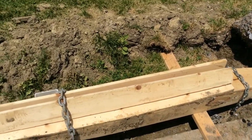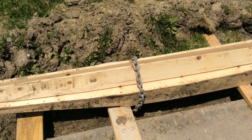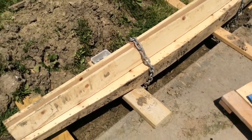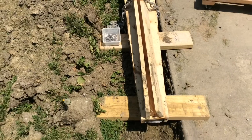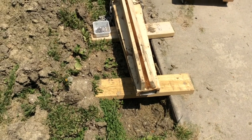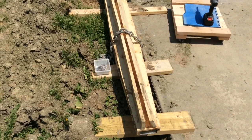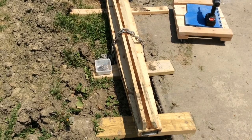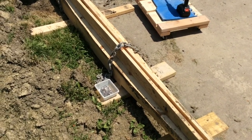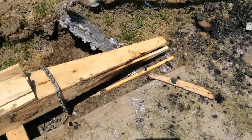I just want to make a couple of comments about the mold itself. That's a whole other video back in, episode 41 or 43. I can't remember which one. But I used 1x4 pieces here to be the bottom of it, for it to rest on. And you can see that they tried to bend. I should have braced that up a little bit with either some pieces inside or some pieces of metal, little angle hardware, anything that would have held that a little better. When it had so much weight in it, those failed. In fact, the one on the front came off completely. You can maybe see the screws sticking up that used to hold it.